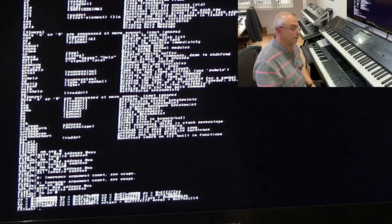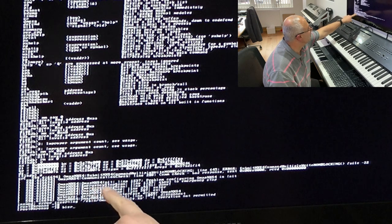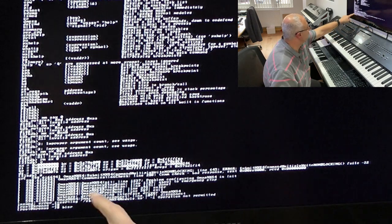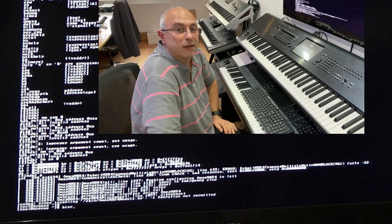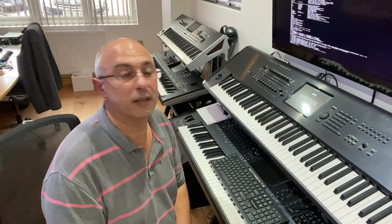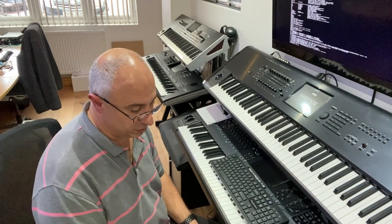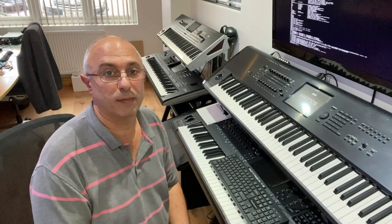And now let's just jump and see what happens. Look at that. As you can see here, there's a submit multiple line error, non-blocking fails 22, OMAP communication line com check bad response, send this and receive that. It means it really is trying to talk to it, but for some reason the URBs aren't in sync or aren't matching up. That's the topic for the next video, I think. For now, you can see we're loading up a lot of things. We only have about 3 files left to load and the whole thing will power up fine.